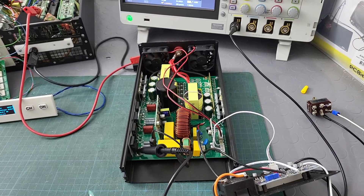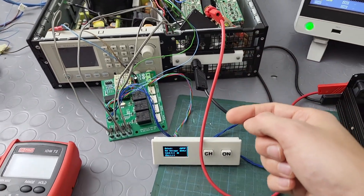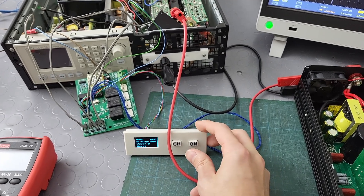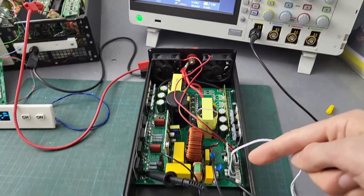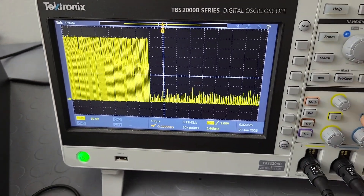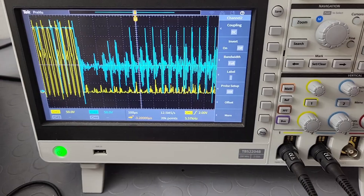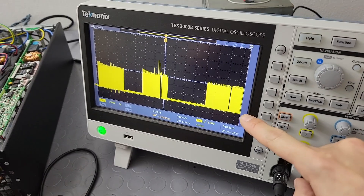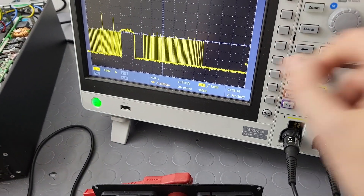I soldered it in, reconnected the inverter to the oscilloscope, and I'm using my big power supply — with a beautiful OLED display, 48 volt 60 amp — to feed 24 volts to the inverter. Switching it on — these pulses don't look like much but they mean the inverter is trying to work, just not quite getting there. Same thing on channel 2: pulsing signals, and most likely the other IGBTs still aren't conducting properly. Checking the gate signals — I'm getting around 6 volt PWM signal at the gate, so the signals are reaching the IGBTs.